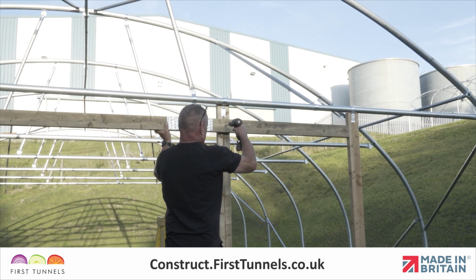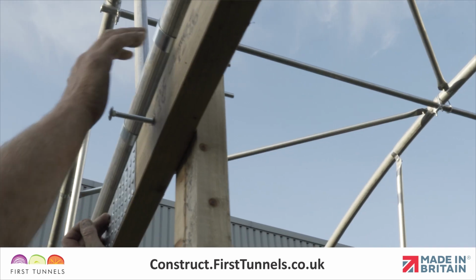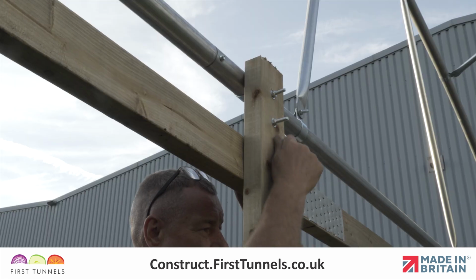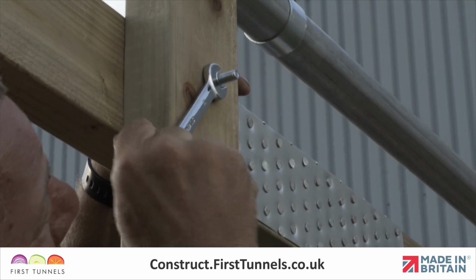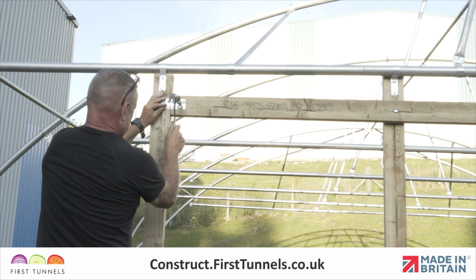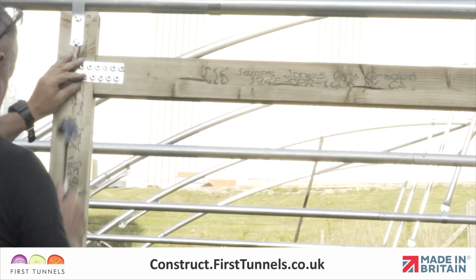On the inner posts, drill a 9mm hole through both the lintel and the inner post. Push a 110mm M8 cup square bolt through the drilled hole so that the thread is on the inside of the polytunnel. Fit the washer and screw on a nut, then tighten. The joints can now be reinforced with nail plates on both sides. Position a nail plate equally across the joint and secure in place with twisted nails.